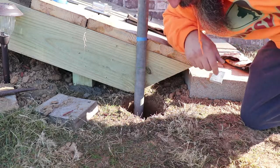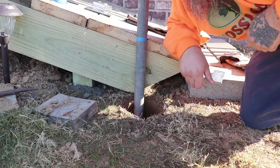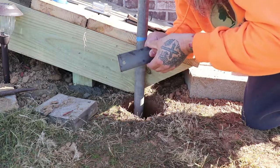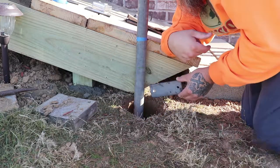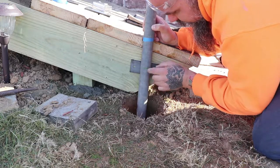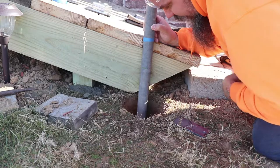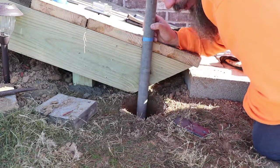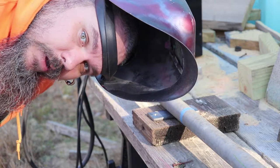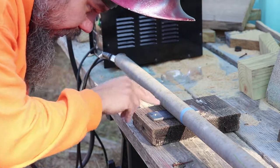Alright folks, I cut all my poles - all poles are cut. I marked 34 inches from the top of each pipe down and put a piece of tape around it, so it'll be easier to line up on the ramp with the 34-inch mark where I want it. I've got these brackets made out of flat stock with two holes. I put the bracket on about where I'm going to bolt it to the wood and made a mark on the pole. I'm going to take these off and weld them over on the work table - it'd be tempting to weld it here but that might catch the board on fire. I've got the Harbor Freight flux core welder and I'll weld the bead on both sides.